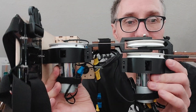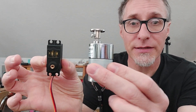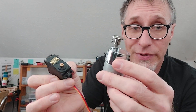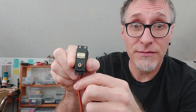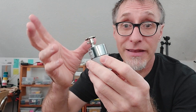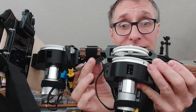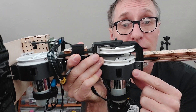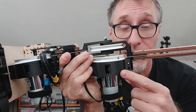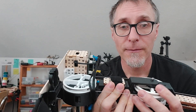This has got two motors - two servos. Custom servos. These are servos, but they're not like hobby servos. Here's your standard hobby servo. Here's the DC gear motor I'm using - both bought off Amazon, both pretty cheap. The hobby servo has three wires: two wires to power it and one wire for the signal. The DC gear motor just has two wires - it's just a motor. However you're going to control this thing, you have to provide that yourself. Enter the custom servo. This gives me the power of a big, cheap DC gear motor, but I can make it smart. This hub makes this motor smart, which means it acts like a servo. It's got an encoder inside which helps me figure out the position and tell it where to go.